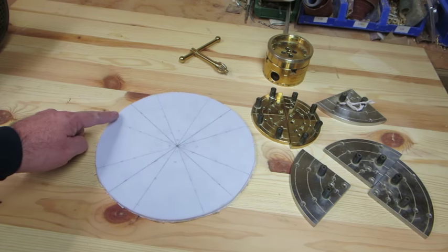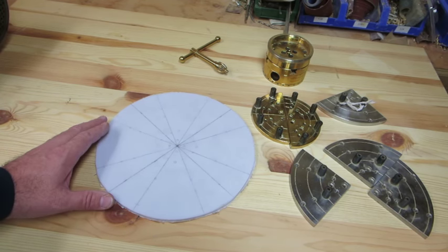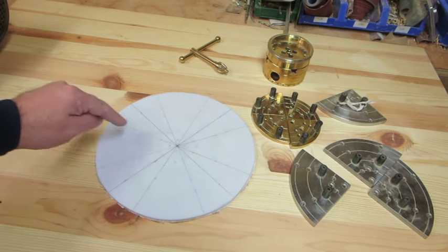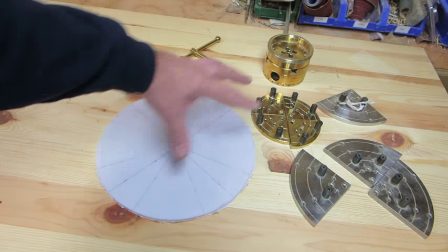I will end up putting this on the lathe and making sure that it's perfect later on, but for now it's close enough. What I will end up doing now is drilling my holes for the set screws that go into the chuck, and also drilling and tapping holes for the plugs that hold the bowl into the cold jaws.